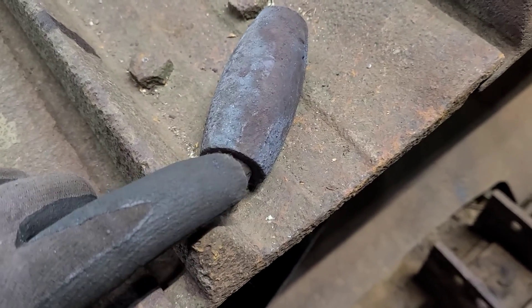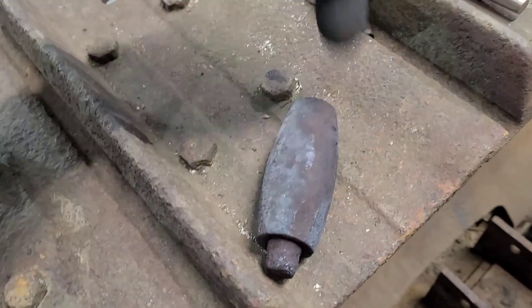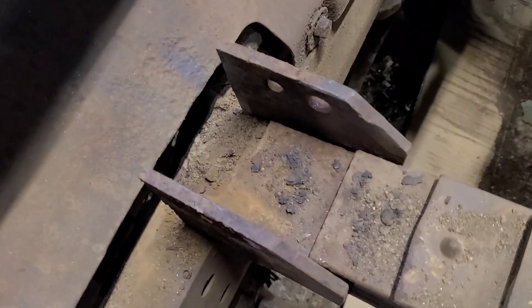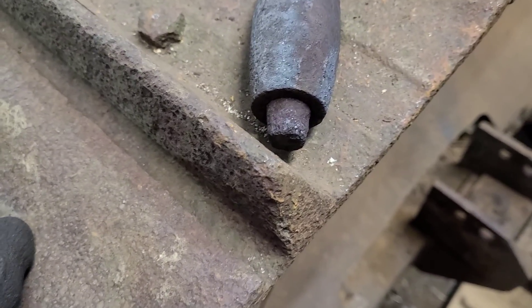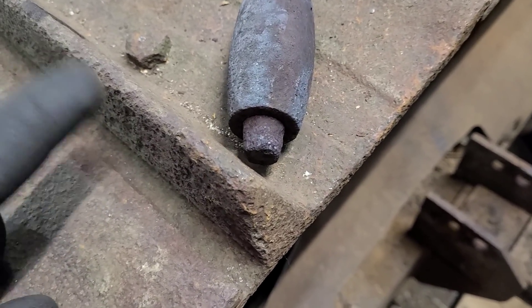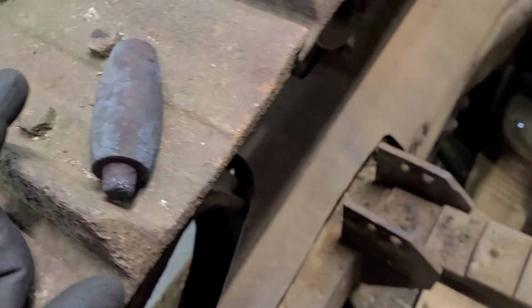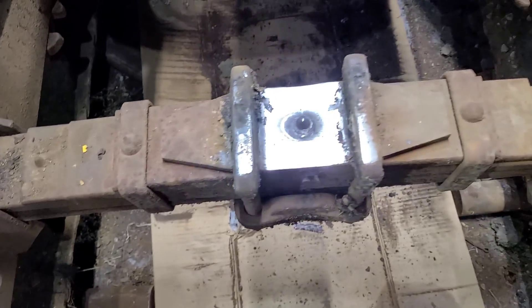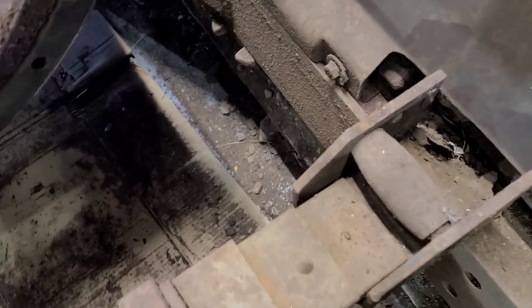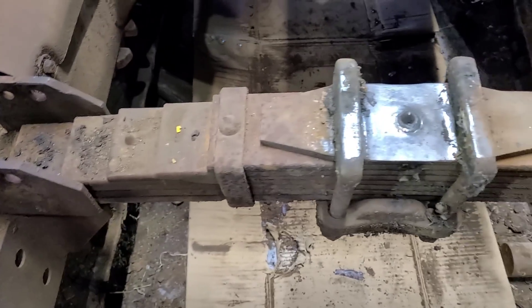Just a little bit of heat. I was able to get that pin to walk inside that collar. Just punched it this way, just enough to squeeze it out of here. It got tight again. I have a feeling we'll probably end up either soaking that in some evapo-rust or possibly even drilling that whole pin out. Now that it's out, we can pull the main spring out. We'll have to get this one out at some point too — the entire works is stuck, the roller doesn't even spin freely. It's not a big deal. Let's go ahead and pull this spring.